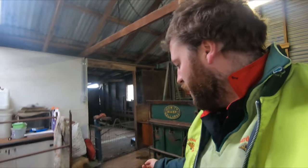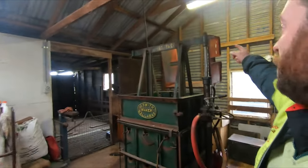All right, now that ram's all back together, we'll slide it into the cylinder and get it sort of half set up. Dad's just over at the workshop cleaning up the nut that goes on the top of the monkey and the ram. So we'll get that in there and try to get that brass sleeve back into the top as well. So here we go. Might need to tap it down with a hammer because it's pretty tight because of the new O-rings. But yeah, we'll see how we go.